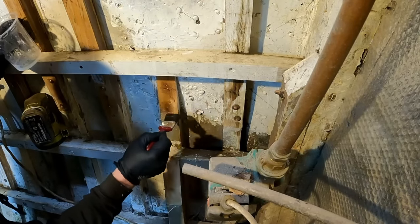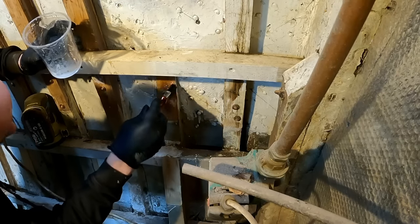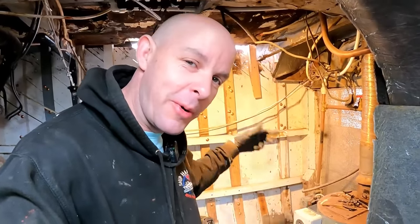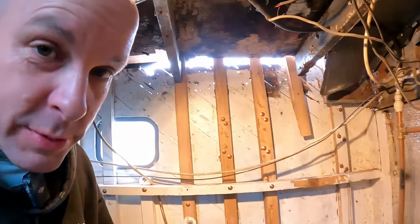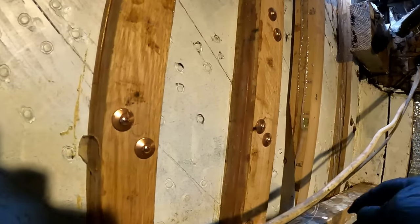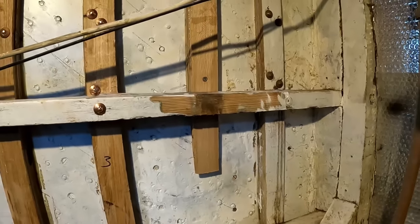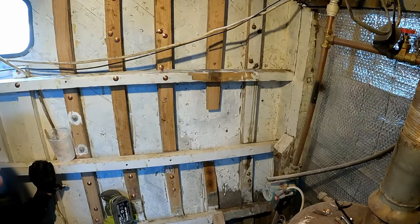A little bit of fine epoxy. Unthickened epoxy anyway. Right, so because this is the last frame in the engine room, Gemma's going to do it, because I've done them all on her, so we'll let Gemma knock this one in. Well, I'll try. Gemma's going to try. So here's a frame coming down now, so I'll try and guide it a bit. Right, so that's good alignment there. Two seconds, Gem. Right, you start giving it a little knock if you want.